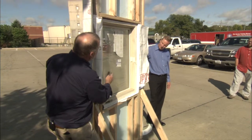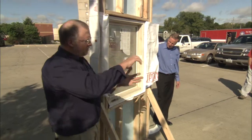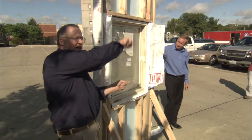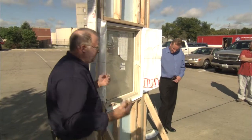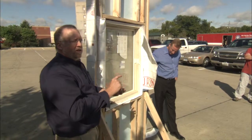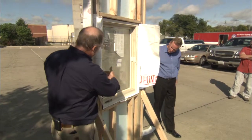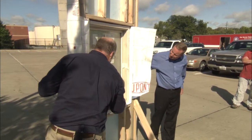When you buy this window, or any window basically, when you look at the brochure you'll have the window with dimensions on the left and on the top. They'll list masonry opening and glazing opening. The one you're looking for is RO — rough opening. The rough opening is what you're supposed to have between this piece of wood, that one, this one, and this one.